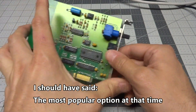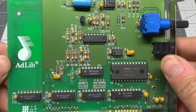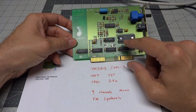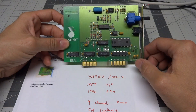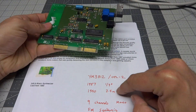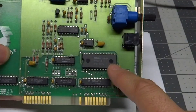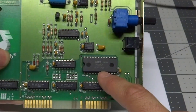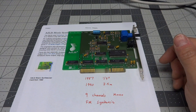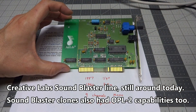So what most people had was one of these — this is an AdLib card, made by a company called AdLib out of Canada. This is a Rev2 card. What this card has on it is an OPL2 or YM3812 synthesizer chip — that's the chip right here. Originally this card came out in 1987. You can tell the original version by having a quarter-inch jack, which I do not have. I have the 3.5 millimeter jack, which came in 1990. The card is a nine-channel mono FM synthesis card, and all of this comes from this Yamaha chip here. All the rest of the chips on here are just off-the-shelf parts. Game support was extensive, and this type of synthesis was carried on into the Sound Blaster line of cards all the way well into the 90s.